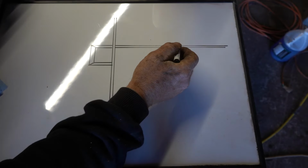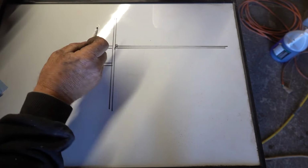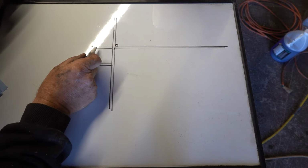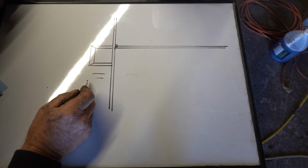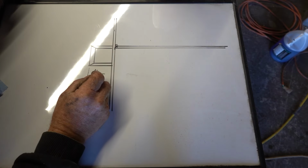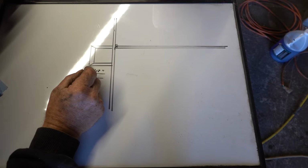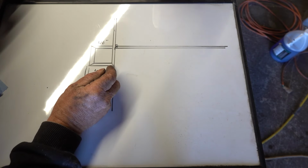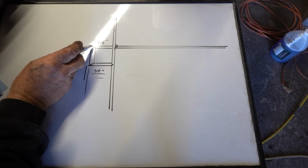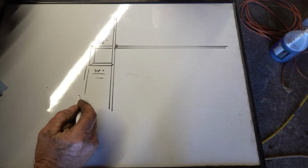Okay, that beam I just drilled the brackets on was right here. Got that done, I got this one cut. Now I have this cantilevered landing on the second floor. I got stairs below. Those stairs are 42 inches, and I need 4 inches for handrail, so this needs to be 46 inches with that little piece going in at a 45 degree. So I'm gonna start working on that.